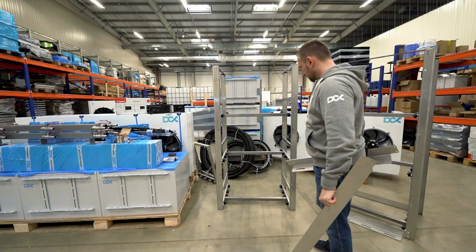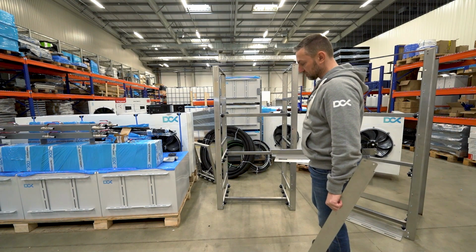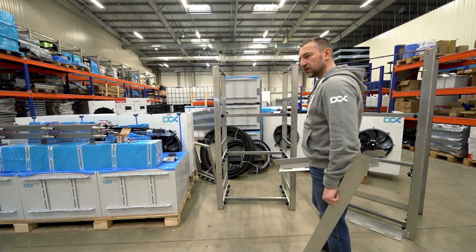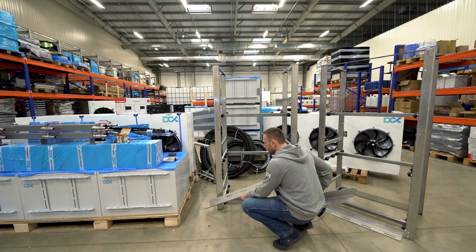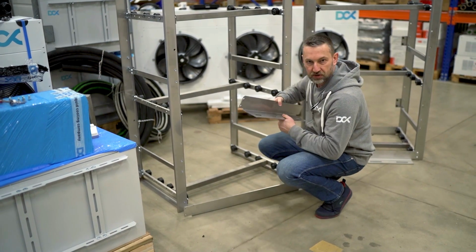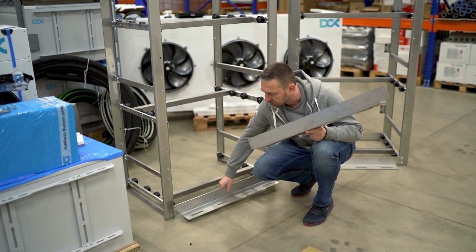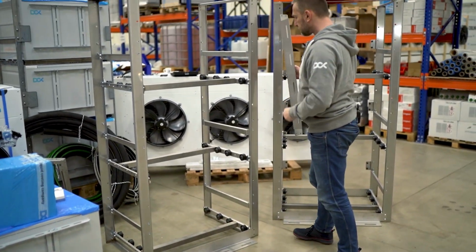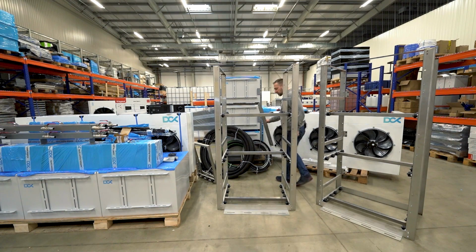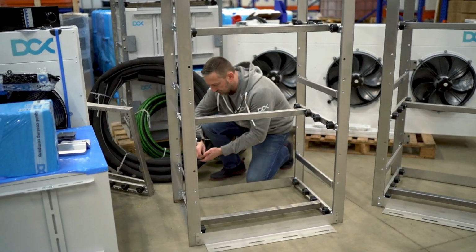We must be aware that we are basically having a system which must support 1 ton of weight. One enclosure is approximately 80 kilograms heavy. And then we also have other components, right? The fluids, 230 liters mostly, and the miners, 300 kilograms per one rack. Yes, that's completely doable. So let me connect the support legs.